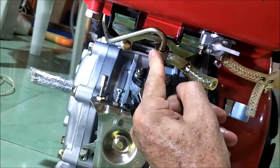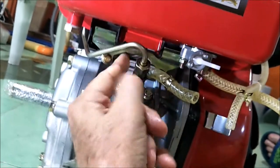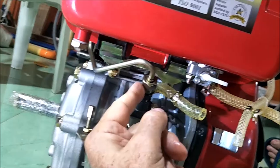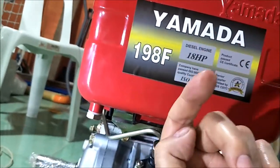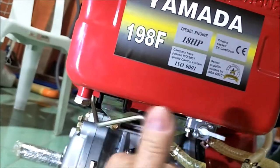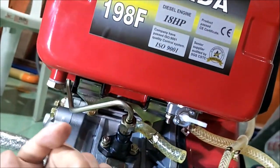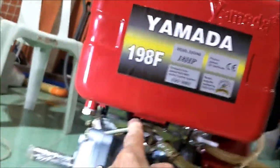Here's the plan. First, we make sure this thing pumps. After we do all the fuel prep, we take this fuel line off the one that goes to the fuel injector, crank the engine with the electric starter — I've got a battery there — and see if it shoots out fuel. It should just go squirt squirt squirt squirt for each revolution of the engine, one squirt per firing of the piston. If the pump is good, we put this line back on.